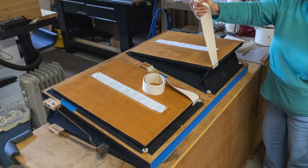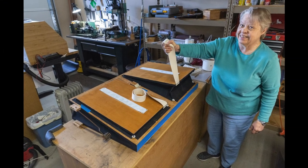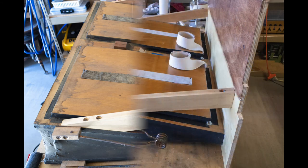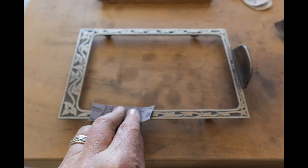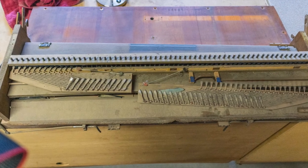Now it's time for a test. The air reservoir holds a vacuum for several minutes now. Here's a before and after photo of the exhausters and the air reservoir. The metal frames around the pedals clean up quickly with a bit of sandpaper, and sections of new carpet were cut out and inserted in the pedal frames. In the next video we'll deal with the upper action.